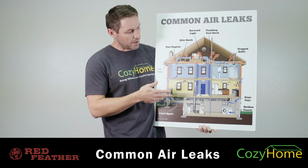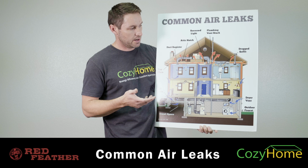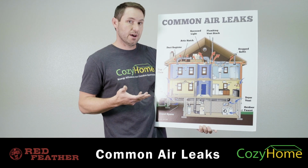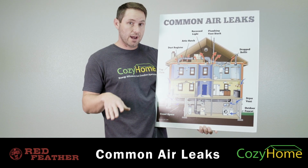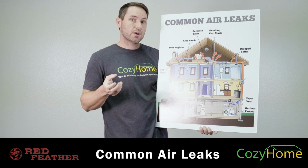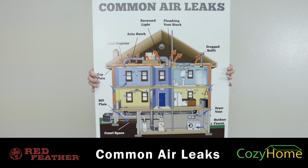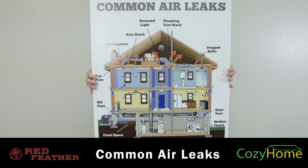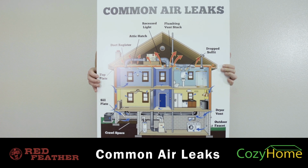All of these spots can be addressed through different materials, and we have some of those in your kit that'll help you seal up these areas. But it is important to think about some of these areas that you might not normally think about in terms of air leaks. One of the ways you can find air leaks is, on a really windy day, to walk around with your hand, or even with a piece of incense, something that makes a little bit of smoke, and see if there are air drafts coming in through different areas. You can check where your walls meet your floors, or around windows or doors. But most people know where these leaky spots are. So we're going to talk a little bit more about some of these materials that you can use to seal up these air leaks.